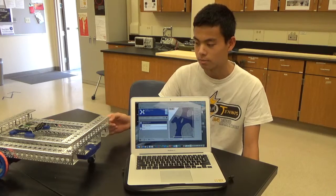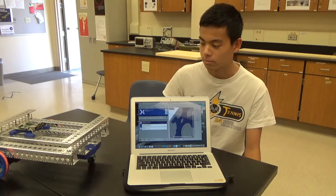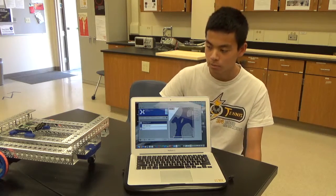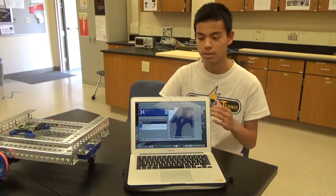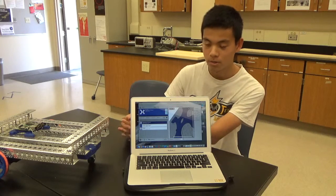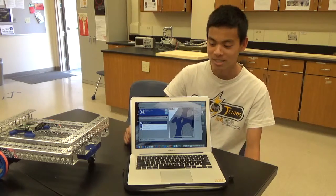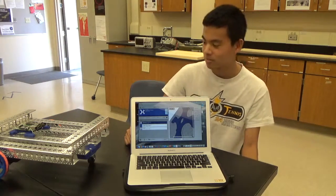So for a couple of the wheels that I printed, the heat bed wasn't set properly and the wheels started to warp, and I had to reprint them. And also for the motor mount, I forgot to add support on one of them, and that resulted in a puddle of black gooiness that had to be thrown away, unfortunately. And that's all, I guess.